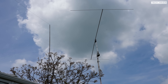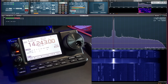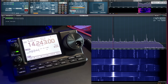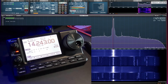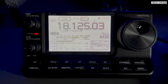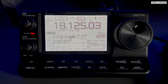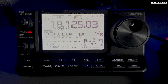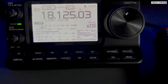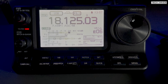Now it's time to test it out. To start with I'll have the antenna facing north to south, meaning the actual beam directions will be broadside east to west. Here's a sample QSO on 20 meters — the contact gives a 5-and-9 report into the UK, and receives a 5-and-9 back. A second contact also comes in at 5-and-7.